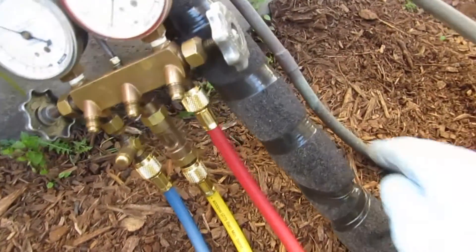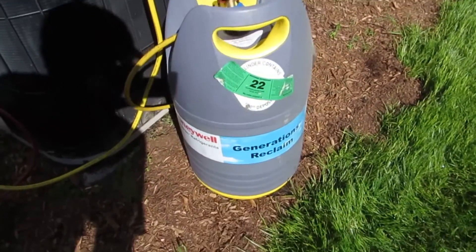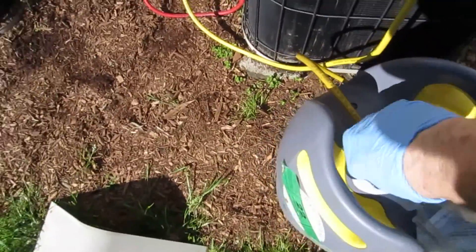I've got the new pan here, brand new, and a new coil going in. I pumped it up as much as I could but I'm going to have to use the recovery machine. See, it's half-inch OD lines coming in, three-quarter. I've got my recovery tank here. This is the kind they're giving us now — no more metal ones for the 50-pounders, there's these plastic ones. They're pretty light, kind of cool. I'll pump it down.